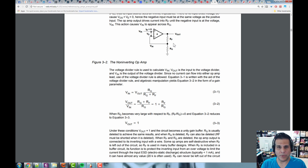So you can't break the rules, but as long as you stay within the rules and usually stay away from the barriers, away from the envelope. You don't want to use this thing all the way to the envelope because then it's going to start to act nonlinear. Say we know that the op-amp can source 500 milliamps. I'm probably not going to push more than 300 or 400 out of it. I'm surely not going to take it all the way to 500 because it's probably going to start acting weird. So if I want 500, I'm going to get an op-amp that puts out an amp.